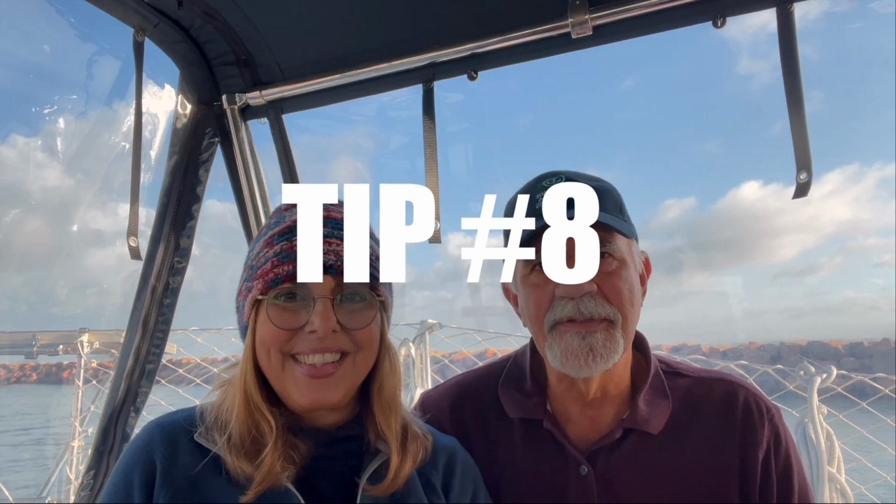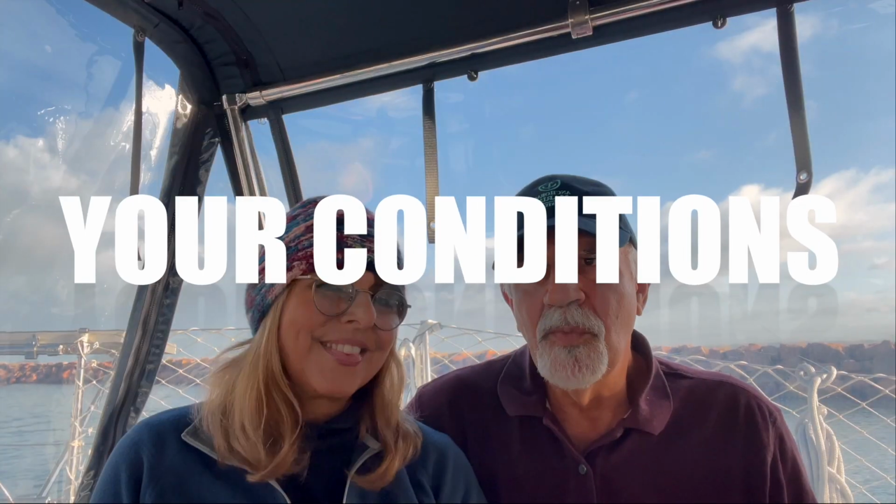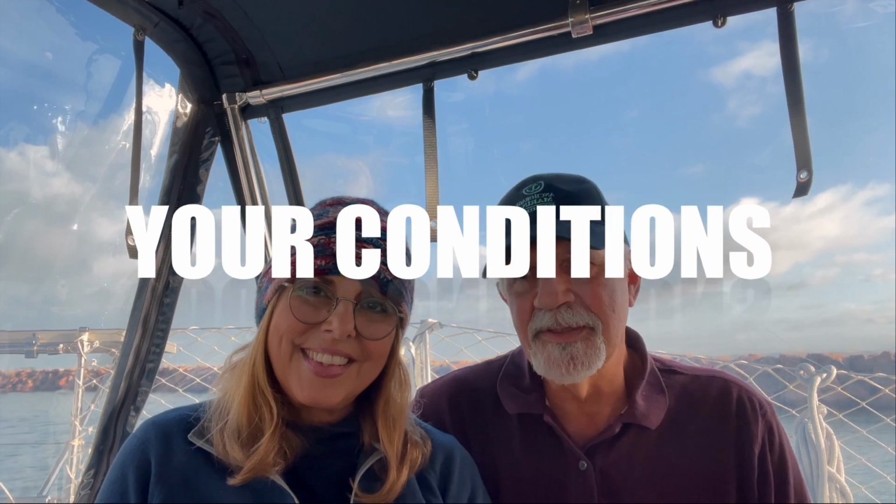One of the recommended procedures for getting that very aggressive pattern is to roll it, leave it 5 minutes to dry, and then go back over it with the roller. Because it's partly dry, the roller pulls it back up and lifts up these little peaks and makes a very aggressive pattern. Different conditions, you may have to adopt a different style. Once you start laying it, you've really got to go with the conditions. If you need to change how you work to suit the temperature, the surface temperature, the wind or the humidity, you just got to do it. So there's no real simple instruction to getting it down right. You've just got to start, and if you totally screw it up, wipe it off.